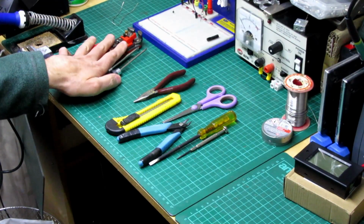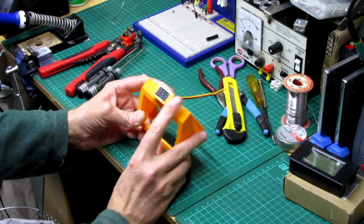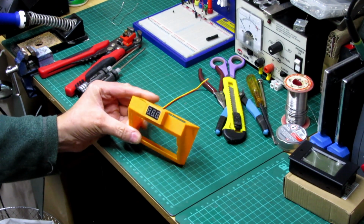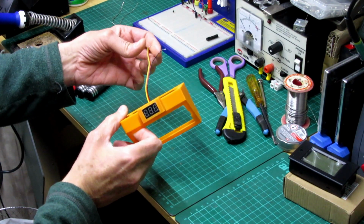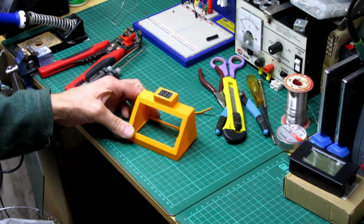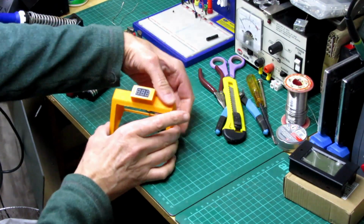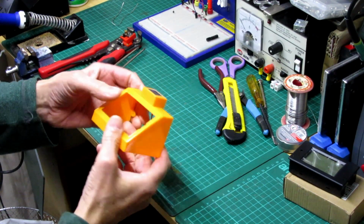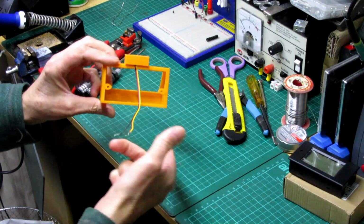So just shift them out of the road a second, because that's what we're going to use. The cover, which I printed out. I've put myself a little 12 volt monitor on the top there, a little gauge which counts up numerically. It's green. And there are 3 wires: a negative, a positive for the screen, and a positive for the voltage for measuring the 12 volts. This thing's worked out okay. I was going to have it that way, but I've decided to have it this way now, because when I stand at the printer I'm looking down mainly. I've just glued that on the top. I printed out a little cube that just fits inside, and the wires are going to come out the back with the wires for the other screen.